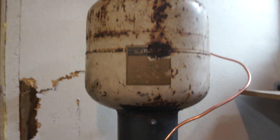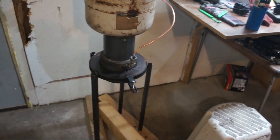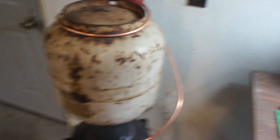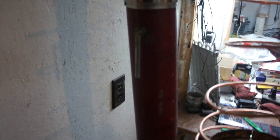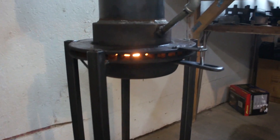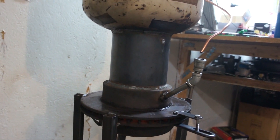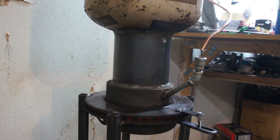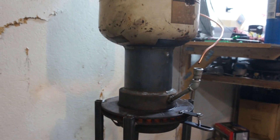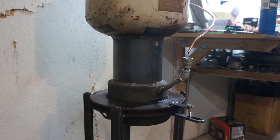We're probably going to get rid of the 20-pound tank and upgrade to a 30-gallon air tank — much larger — to get a larger combustion chamber and secondary combustion chamber size, so we can cool that exhaust down a little more before it goes out and keep the heat in the tank longer. We'll put this setup on that other air tank and see what happens. We may also have to add some extra air holes. With the two-inch chimney we needed to increase chimney size, not incoming air — it used our test hole as a chimney. We increased our chimney size and it does run better, but we don't get the heat out of it that we did before. It burns cleaner though.